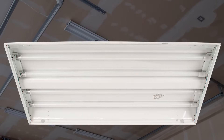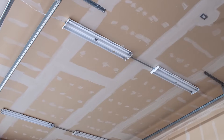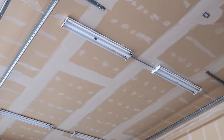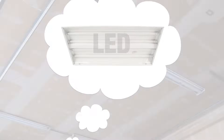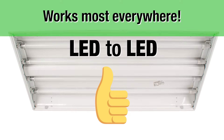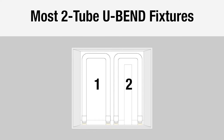Today I'm going to show you our new A plus B LED tube to retrofit your existing fluorescent fixture, or work in a fixture that has already been converted. If your fixture is fluorescent and you want it to be LED, this will do it. And if your fixture has already been converted, this will work in that fixture too. It works most everywhere — all four-foot fixtures and most all U-bend two-by-two fixtures work with this one simple tube.